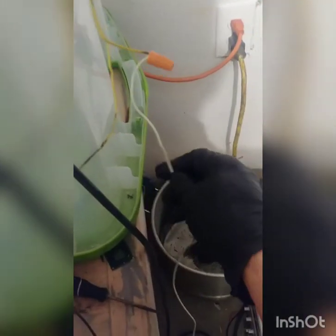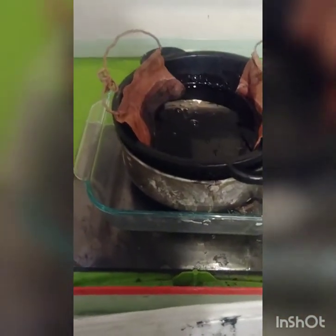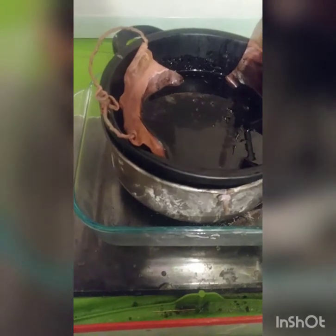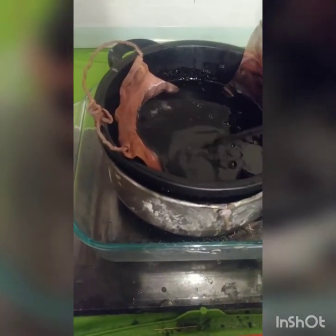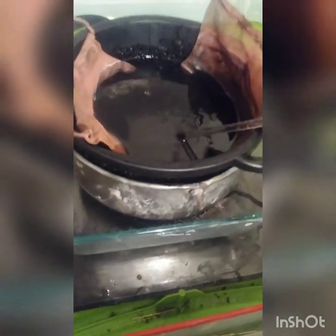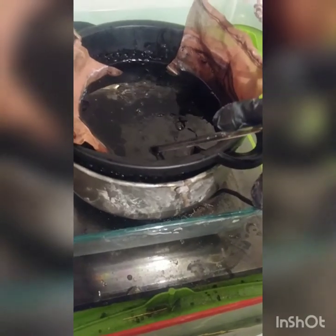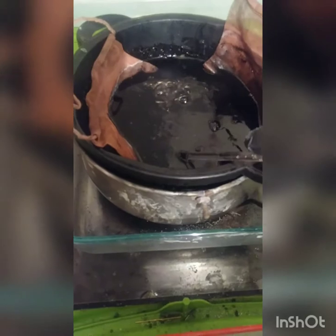Running a long extra wire also helped reduce the heat. I haven't had the hot wire issue lately. You can still see material in there — getting every last bit is sometimes the tricky part, because the cell can stop working and you'll pull the pins out and still see gold on them. It makes you wonder if some weren't gold-plated, considering the cell didn't strip them. Just be patient, get your reaction going again, and get all that gold.